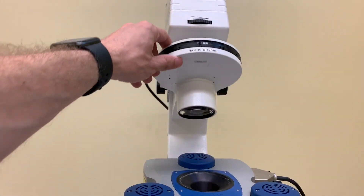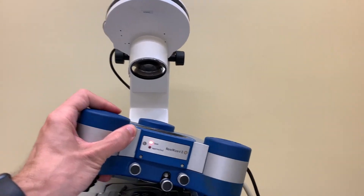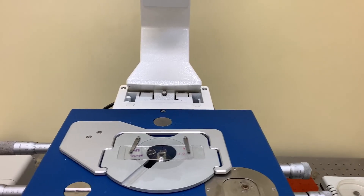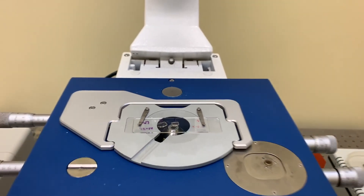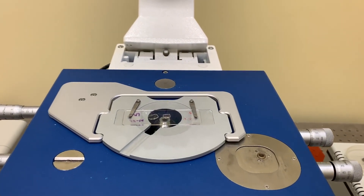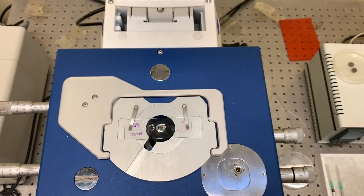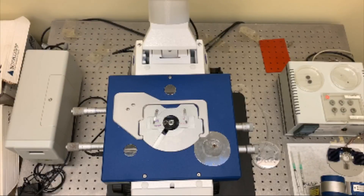This is the actual AFM. When removing it from the microscope, a light indicator should turn off letting you know that the laser has shut off, keeping you safe as you insert the AFM probe holder with your AFM tip. This is where you insert your sample of choice. In this case, I had dropped a dilute water-based solution of collagen fibrils, added a droplet to a small piece of mica — which is an atomically flat surface often used in AFM imaging — glued to a standard microscope slide, gave some time for the collagen fibrils to settle, rinsed with deionized water, and air dried until ready to image.